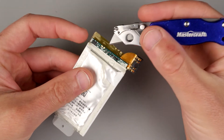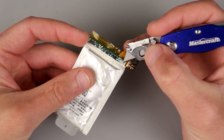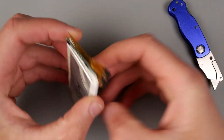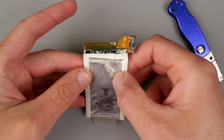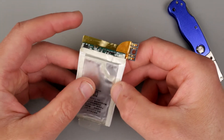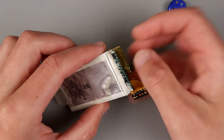There are some numbers over here: BESP906G, HY328, and V0368 — those are all different markings on this board. I'm also curious if this circuit board could be reused with any other battery. Potentially no, because these controllers can be specifically locked to work with a particular battery and particular chemistry — with a different battery it's gonna be all wonky, or it may just not work at all. For example, some of those controllers, if they detect the battery is completely dead, they won't accept a new battery anymore.